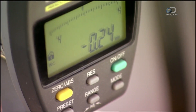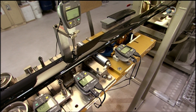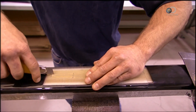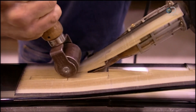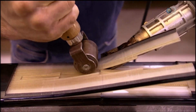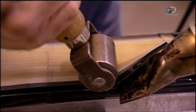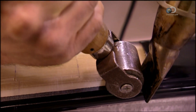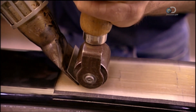The handrail shape passes through measuring devices that check its dimensions. The ends of two plastic handrails are spliced together to form an endless loop. Using a roller, the wires and plastic sliders of the inner carcass are pressed together, and hot air is blasted into the splice with a heat gun. This softens the plastic so that it melds together.